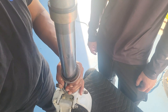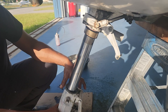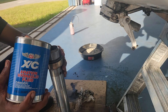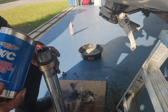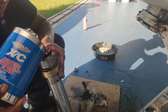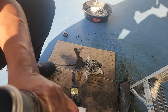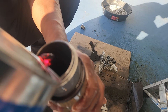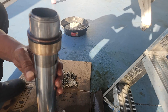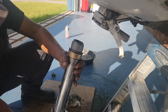Make sure this is all DC-4 lubricant. There is a fast way of getting fluid into it. After you put the fluid in, fill this up or you can put it in after. How high up does it go? How high up to the collar? You see where the fluid started leaking out? I leave it just a little bit below that, so when you're ready to put fluid in you're not spending all day on it.